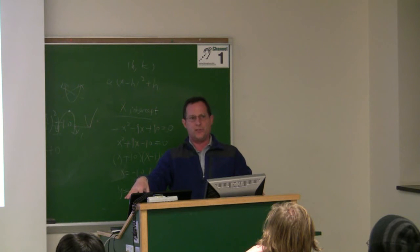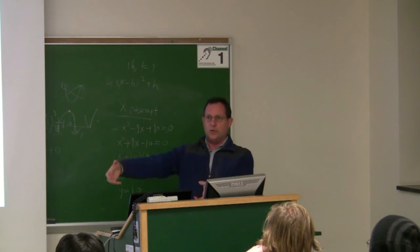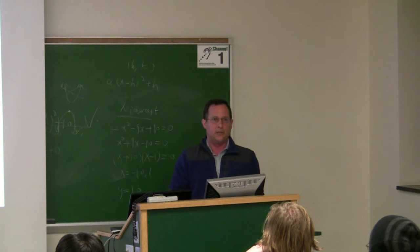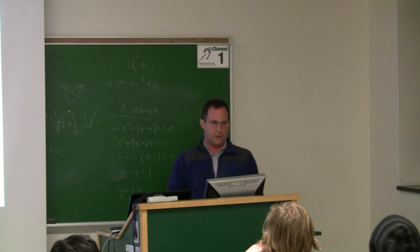If both amplifiers were doing the same thing, the speaker wouldn't produce any noise. He amplified the difference between them, and he took his amplifier and modified it. No topology changes, only component changes. The first thing he changed were capacitors. He took out his crappy coupling capacitors and put polystyrenes in, which were these $25 capacitors. And he was able to cut the difference between his amplifier and the other amplifier down to zero.